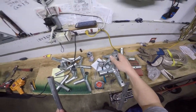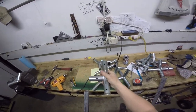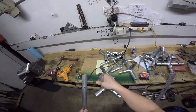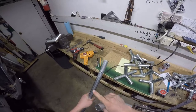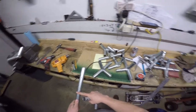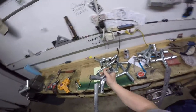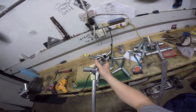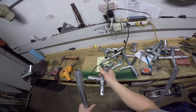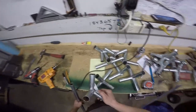I figured out that these things are not all the same — some of them have a much deeper pocket than others. I was thinking, if I try to have it the same distance from the end on all of them, then I'd have to get the exact right lengths to go in these and mark them all, which would be a bunch of screwing around. Then it occurred to me I can just measure from the bottom up the same distance each time. I figured out this angle piece here is about two inches long, so I have to be out further than that.